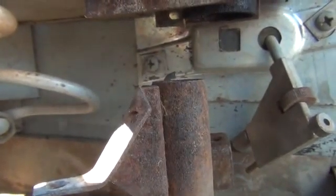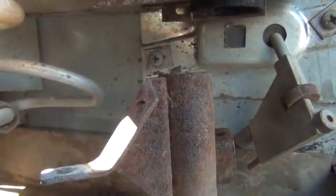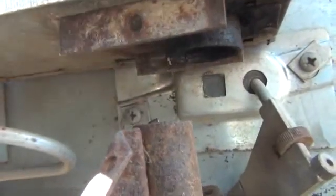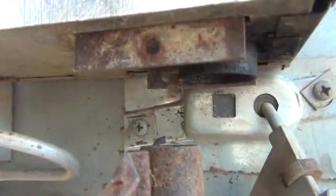That's a pretty good refinement right there when you're not seeing a lot, especially for the heavy crude I've put into the system. Most of this should be invisible. I want to take you into the condensation jar here — you can actually see the liquids inside building. They're the clear liquid, not the darker colored stuff. That's a biocrude jar I use, so it's still stained with some biocrude. But you'll notice there's a great amount of condensation happening inside our jar of gasoline-style fuel. It's nice and fogged out inside, and with as much as you see coming out the end, it means we're gaining most of what's in there — almost nothing making it out.